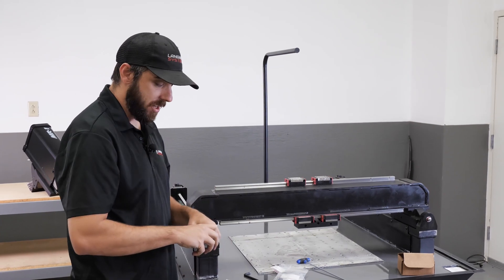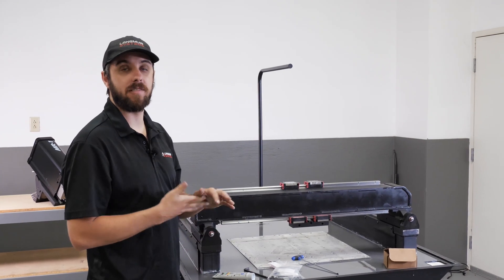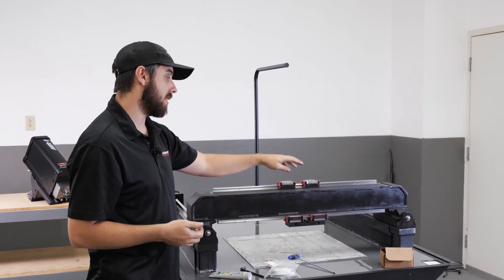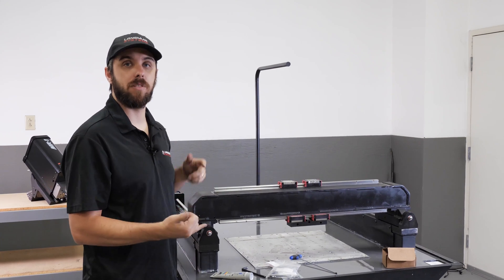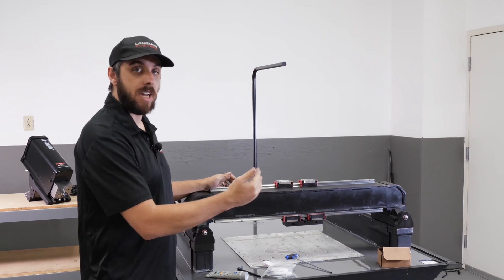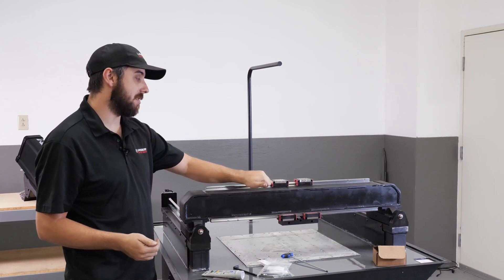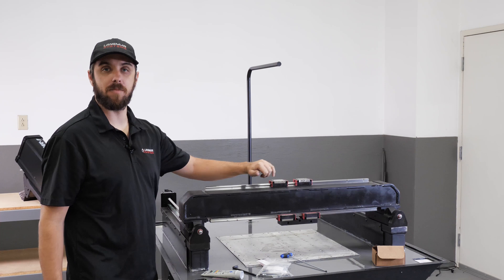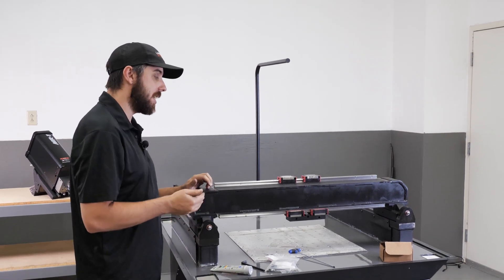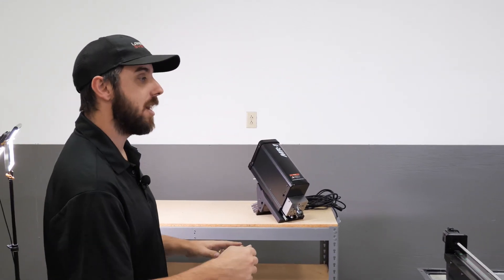At this step, you're really going to want to get somebody to give you a hand to get the XZ carriage on there — it's about 80 pounds. What really works well is if one person gets the XZ carriage into position without displacing the shims, and then the other person can get the bolts and the wrench and get them put into position. It's really important that when you start tightening the bolts, you're applying pressure towards the gantry, because we want the reference edges on the carriages to clamp or squeeze these shims into position. When that occurs, we know we're going to have the best possible alignment.